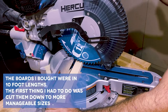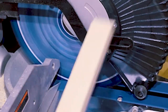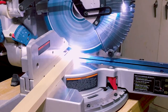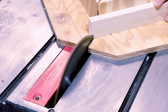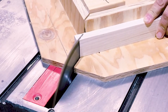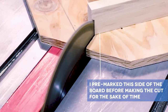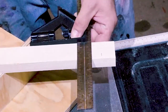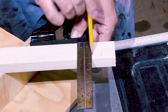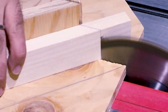To start making large size cradled art panels, I first cut down the stock into pieces that are more manageable. The parts list shows the pieces that will be used for the cross bracing. The cross bracing can be cut down to their exact length and doesn't need to be oversized. The stock that will be the cradle outer wall will need to be cut slightly oversized by about an inch or more, so there is enough room to cut the miters without cutting those boards too short. Once all the parts are rough cut to length, we begin by cutting the mitered ends on our outer wall pieces, marking the top side of the stock with a 1 or a 2 as we make the cuts.